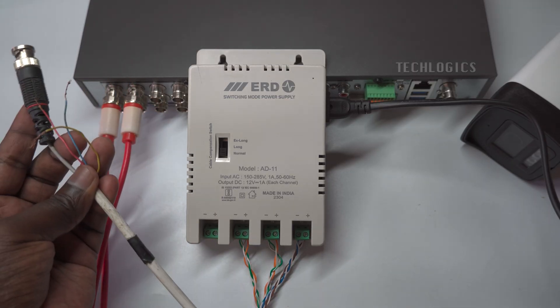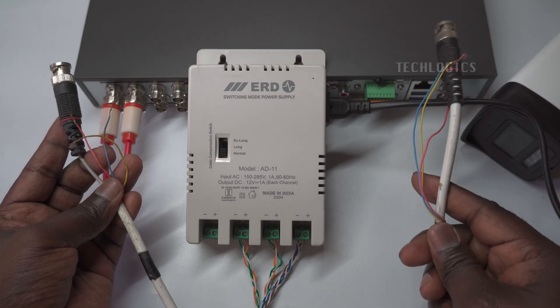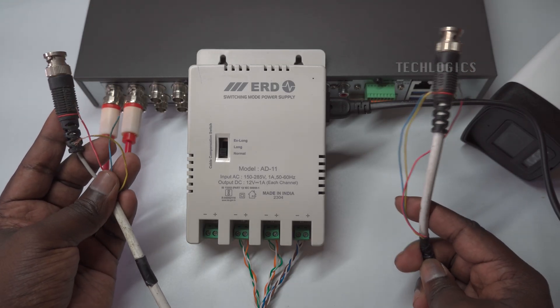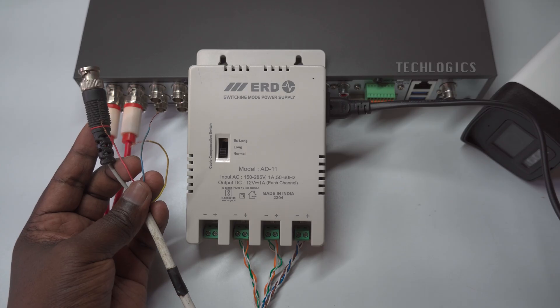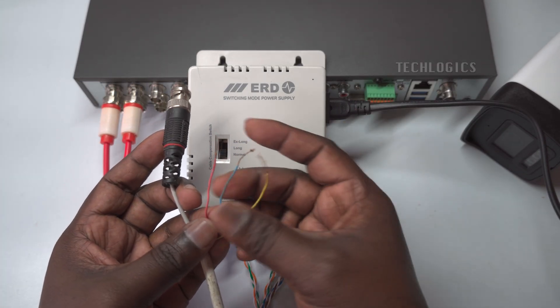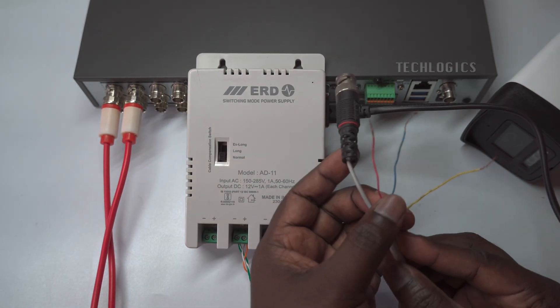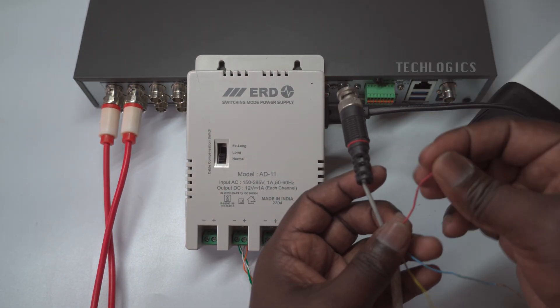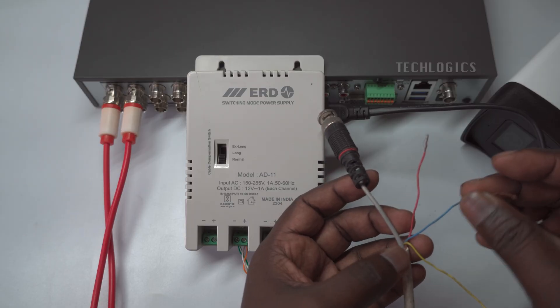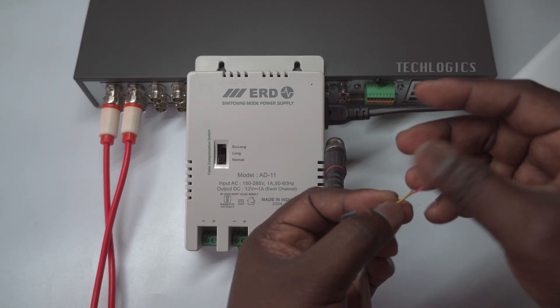Use these three wires solely for the camera's power supply. When using this type of cable, do not exceed a length of 70 meters, as hybrid cameras require more power than basic analog cameras. To ensure full functionality, keep the length below 70 meters. For longer distances, please consider using other cable types such as CAT 6 or RG6 along with a separate power core.